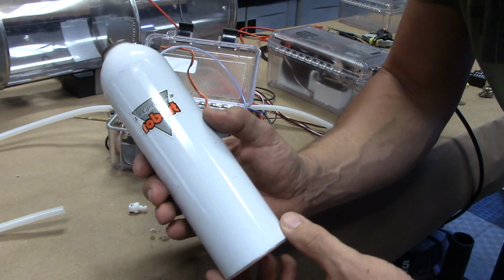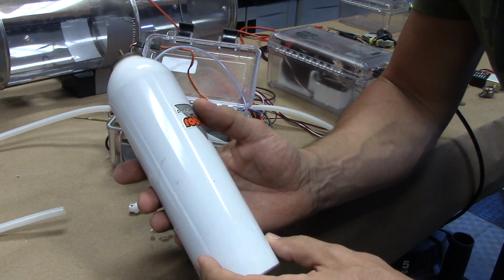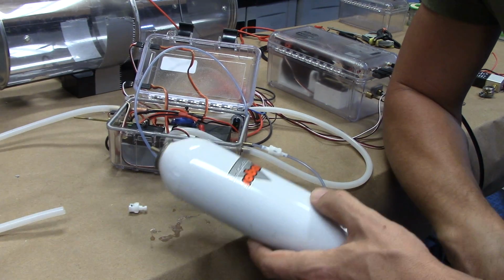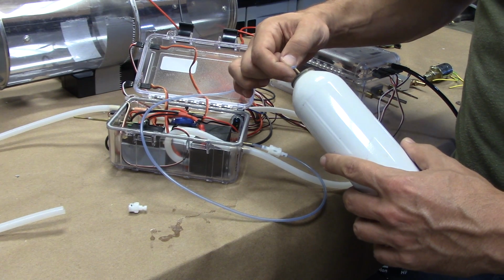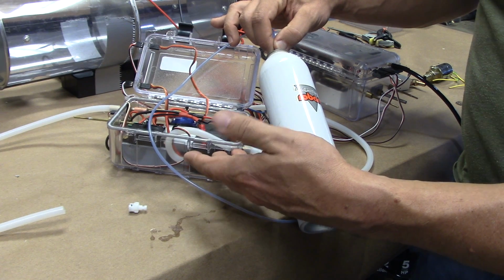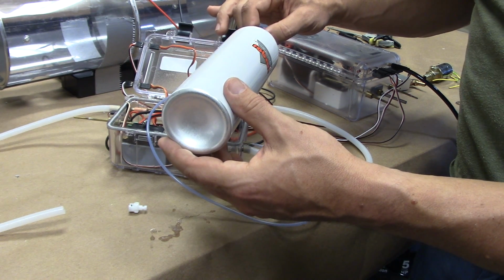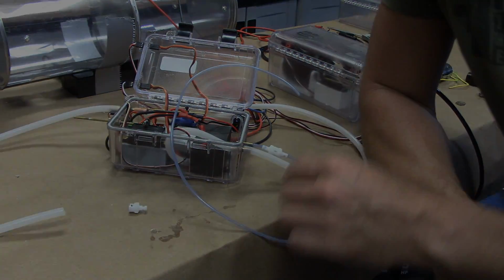And what I'll be sending along with the owner is this Robart air reservoir, and basically this is what it was designed for, air retracts for aircraft and that sort of thing. Super light, but basically you just connect this air hose to it, and you've effectively doubled the volume of the interior there. You can use this for extra flotation in the model, mounting it high up under the surfaced waterline. You're going to have to add foam anyway. You might as well make it functional.